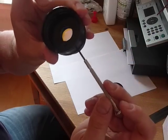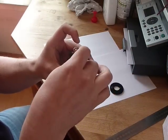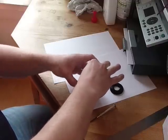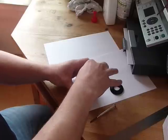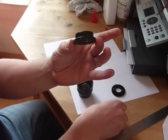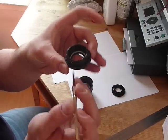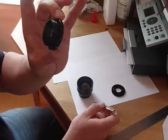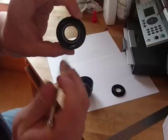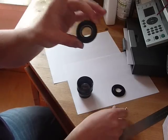You can see that if I tune it, it actually rotates that assembly. What I can do is tune that all the way to slacken this off, and then I can just unscrew this - it really does unscrew, I'm going to do this by hand. Again there's no loctite on this because it's designed to be a free-moving part. So we'll take that out like so. You can see the holes where the screw on the tuning ring goes in, a quite coarse thread there. There's a lot of grease here - it's a clear grease and it's quite runny, not very viscous.